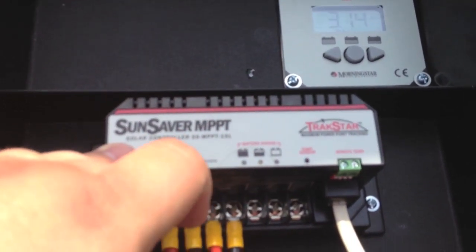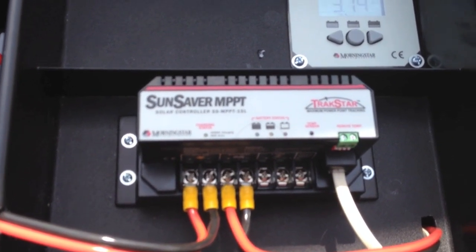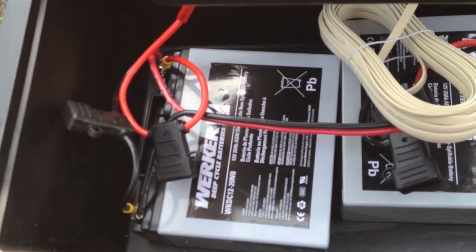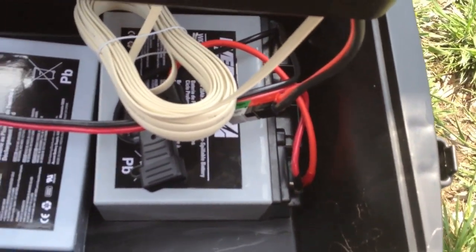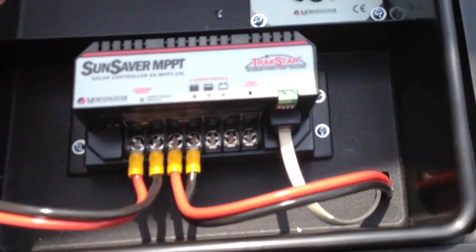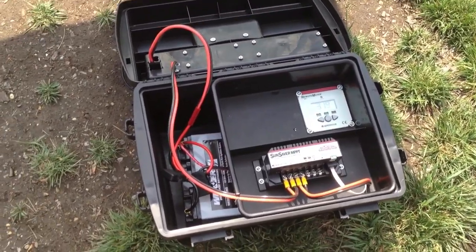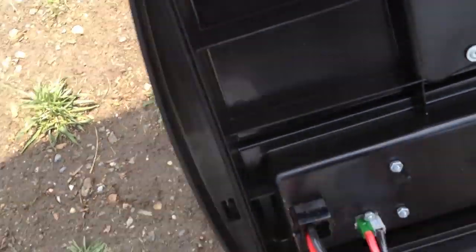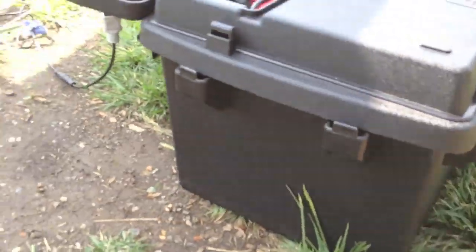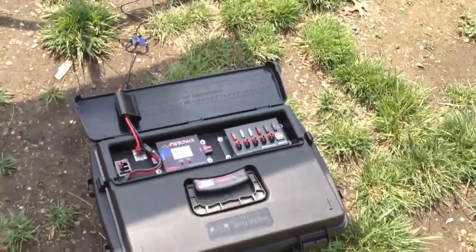The other nice thing is that if this were charging my load, it would disconnect the battery at 10.7 volts — and for sealed lead acid batteries you don't want to discharge below 10.5 volts. This tray came with the box and is removable, and down below are the two batteries. One thing I still have to do is get some styrofoam or something to wedge those in a little better so they can't move around. All told, I am very happy with this project, and the best part is that I've had to drill no holes in the actual box, so the box still remains waterproof or resistant with that lid closed.